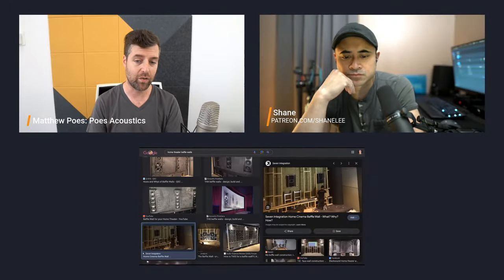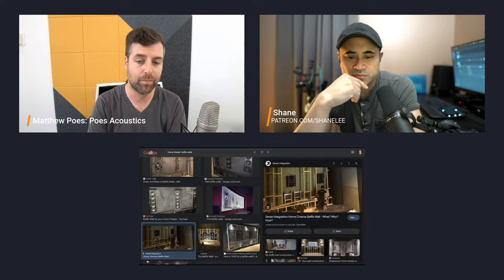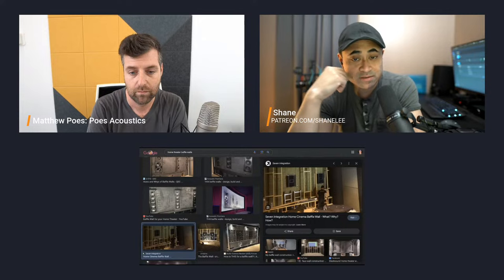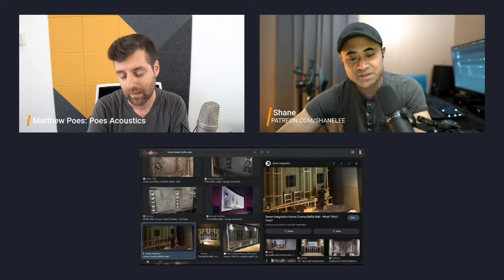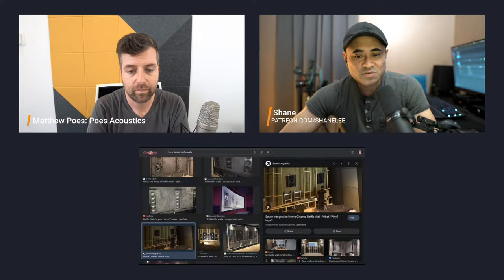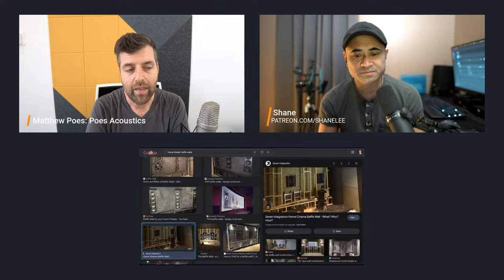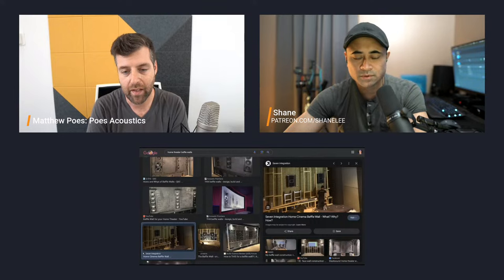You can still address low-frequency issues without over-absorbing the room, because you want some absorption on the sidewalls, ceiling, and back wall too. You could use membranes and other approaches. You can put pegboard over the front wall insulation and then put black fabric over that. You can use drop cloth plastic — the highest mil thickness you can get, not cheap garbage-bag thickness, but something actually substantial.